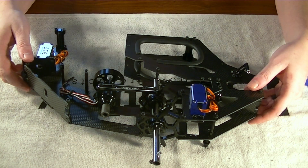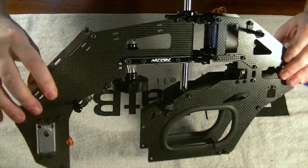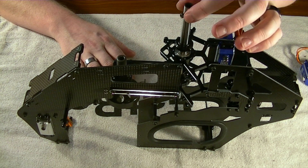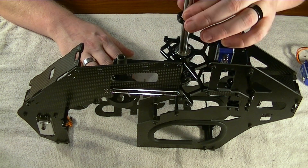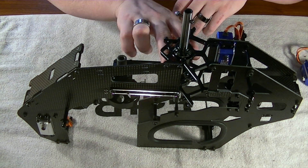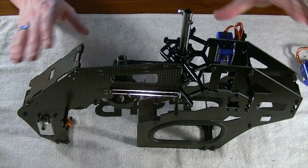Alrighty, so here we go. We've gone ahead and joined the frames. We now have them together — you can see it makes a really nice solid block. It feels good, it feels firm. You can stand up the machine now if you want to. Like I talked about with the main shaft, that thing is perfect. If it's hard to pull up and down, if it slides or notches or something, there is something not right — so double check. I like to keep this in at all times. Squared up the frames and everything, got them locked down.